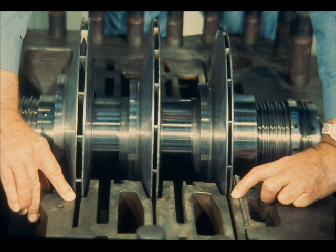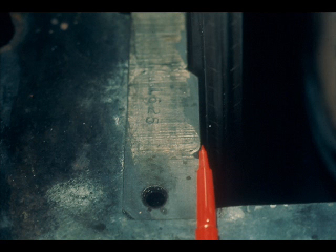This is a picture of a centrifugal compressor rotating assembly adjusted to its running position within its case. The alignment of the impellers with their diffusers is attained with the shaft adjusting shim, just as with the pump rotating assembly. Here's another example: this steam turbine rotating assembly is adjusted to have the correct gap between the nozzle and the buckets on the first wheel, and the adjustment is done in the same manner. There will be some variations in the procedure, but the basics will remain the same.